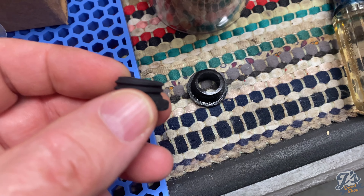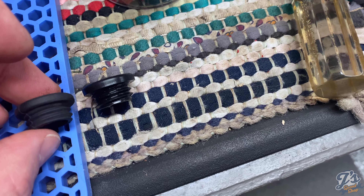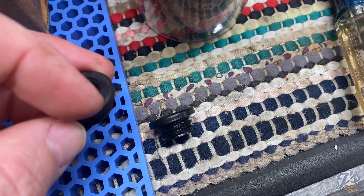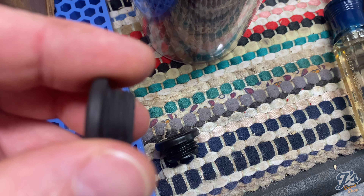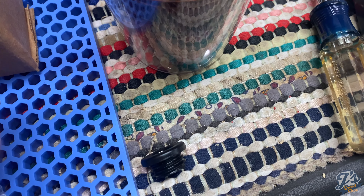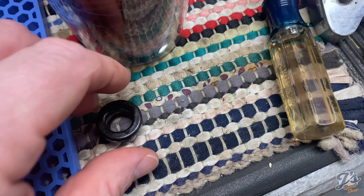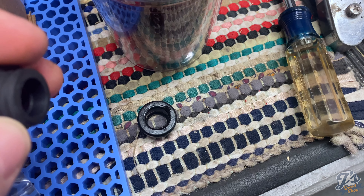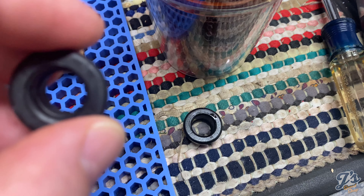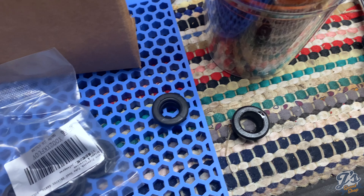This is the pack of replacement seals for the dipstick tube on the lawn tractor. The one that came out looks much identical to the new one, but the difference is the new one fits much snugger on the dipstick tube and it actually threads down into the engine block, which has matching threads. Before it was wobbly and loose, but now it's nice and snug. The old one doesn't look damaged - I think it's just years of being soaked in oil that caused it to deform or wear a little and not seal anymore. The dipstick tube goes in right above the oil drain plug, which is why I originally thought the plug was dripping. I'll put a little Teflon on the plug as well, but this should take care of it.